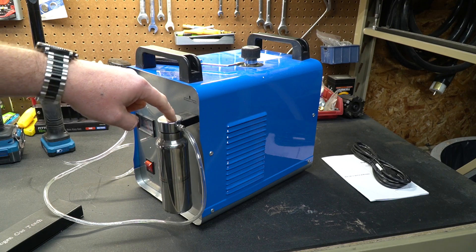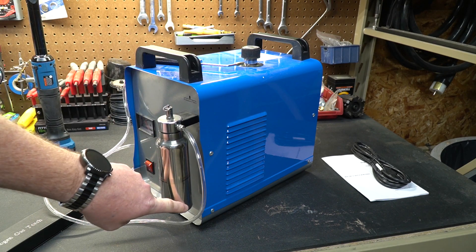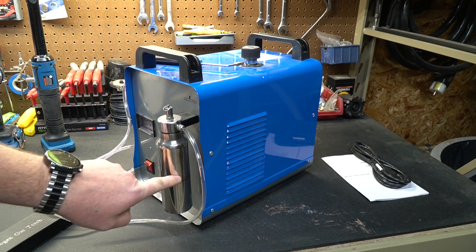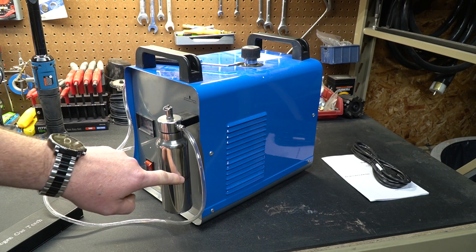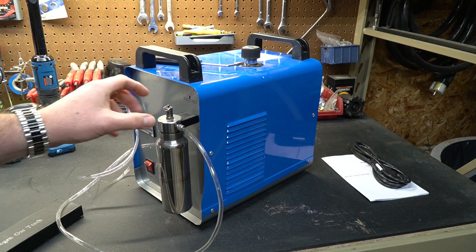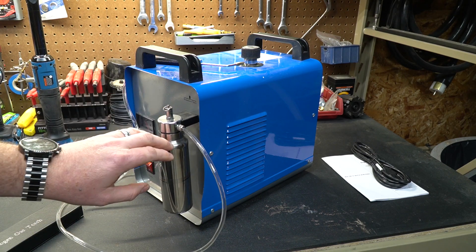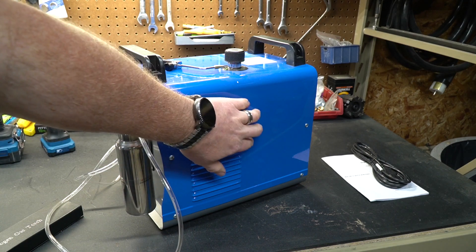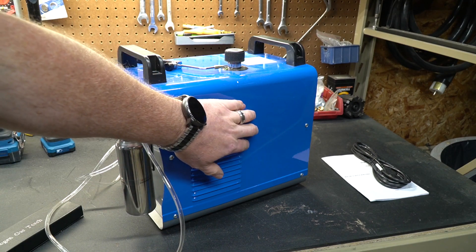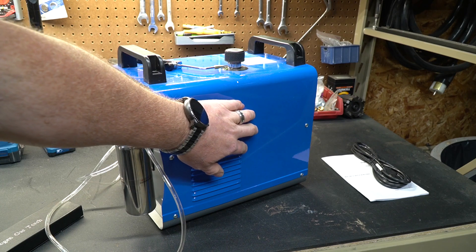There is a line that goes all the way to the bottom of this canister and you put water in here. Some people use alcohol or an alcohol-acetone mix. If you were to get a flashback, this particular container would prevent the big catastrophic boom because it would prevent it from flashing all the way back to the main container, which may contain a lot more hydrogen-oxygen mix.